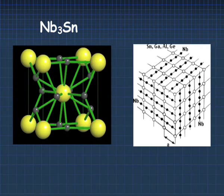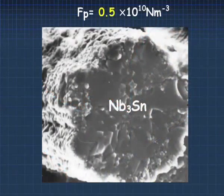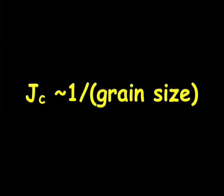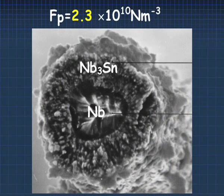Crystallography allows you to determine the degree of atomic ordering, and the degree of atomic ordering is directly correlated to Tc, to Bc2, and to the critical current density. Because you have the capability of manipulating the temperature at which you do this, you could go very high. If you go very high, what happens is the grains of the A15 — the Niobium-3-Tin phase which is growing — become very big, perhaps half a micron or a micron. You soon discover that if you do that, you don't have as much current as you would like. So what you do is keep the temperature down, and you find that you can get the grains perhaps as small as 100 nanometers.